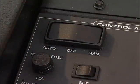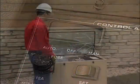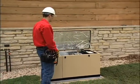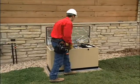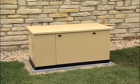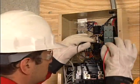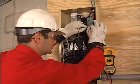Pull the handle down to move the main contacts to the standby power or generator position. Never operate the transfer switch manually when loads are connected. Put the generator's mode switch in manual and wait for the engine to start. Allow the engine to warm up, then switch the generator's main circuit breaker to the on position. The generator is now supplying electricity to the transfer switch but is not carrying any load. Using a multimeter, check to be sure that voltage and frequency from the generator is correct.